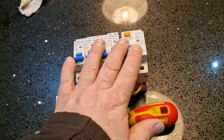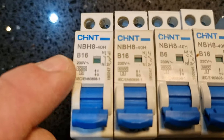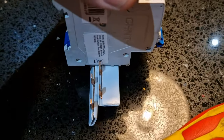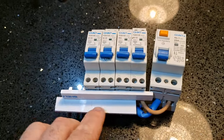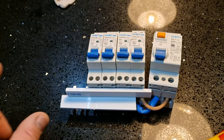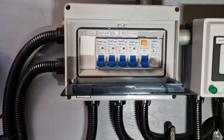As well as adding all the new breakers, I've actually bought some bus bar — this is BB01, designed to fit this type of breaker. A meter of that is about 30 quid, but it was on offer so I got a meter for 13 quid. It makes all the connections on the bottom a lot tidier. I just need to replace that plastic cover — I marked it yesterday, so before I put it all together I'm going to inspect it, and if there's any damage I'll swap it out. All ready to go in.